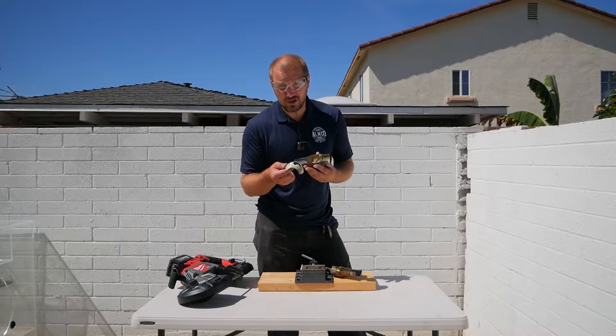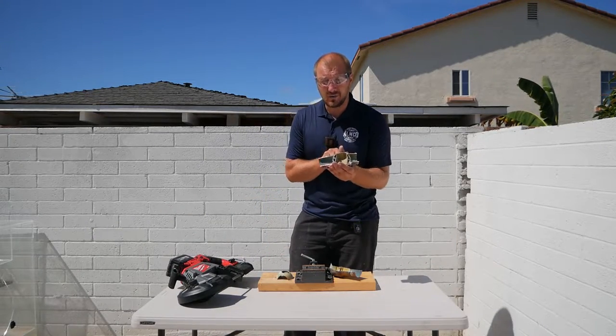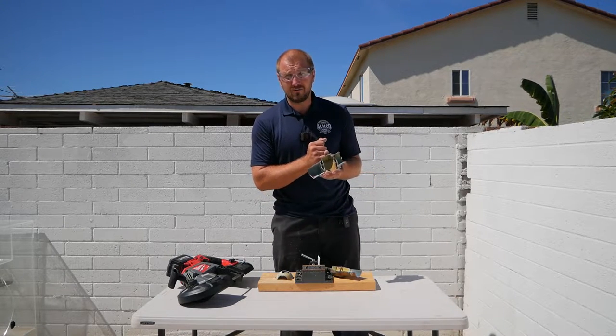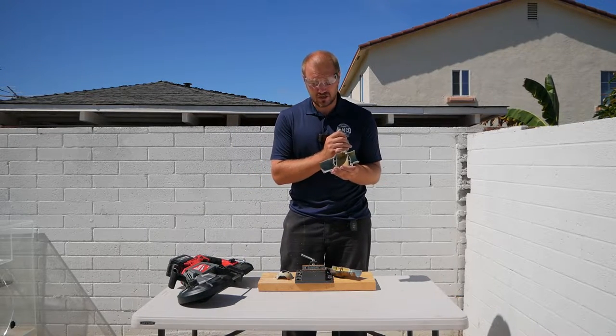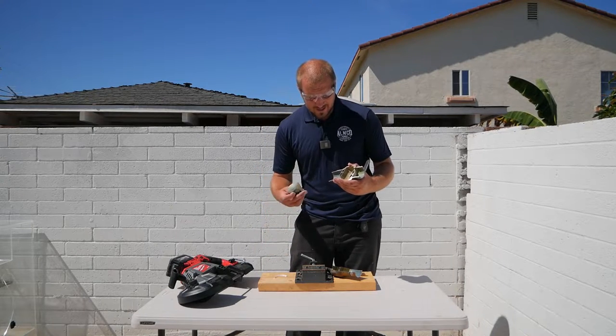With all this corrosion, you're not able to turn the valve on and off. This valve must always be 100% on or 100% off. If you turn it just a little bit, trying to catch your pressure — it doesn't work for pressure control. It just makes less flow, but the pressure stays exactly the same.